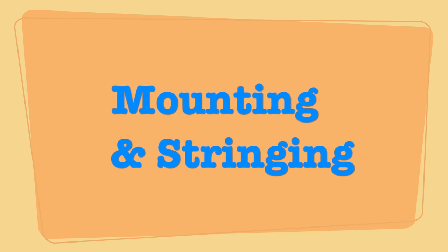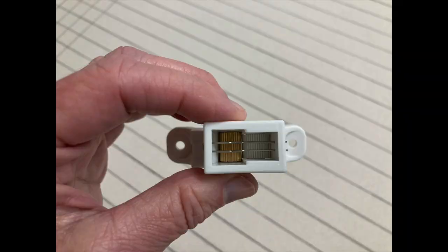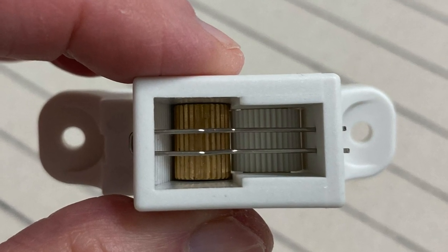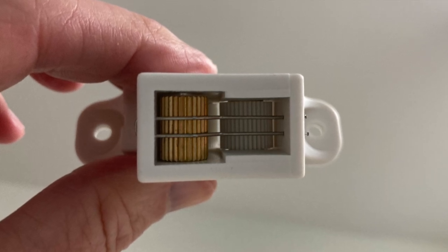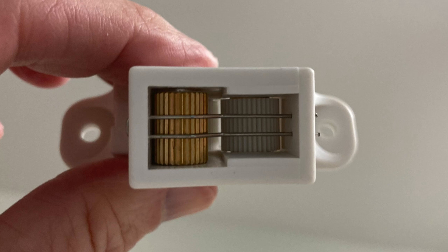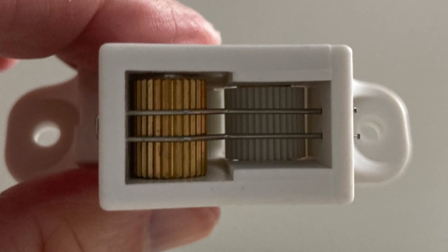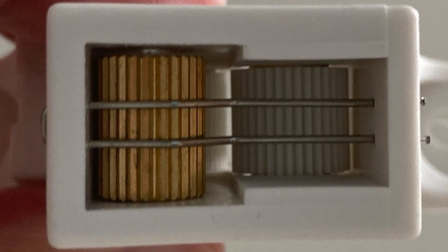Let's talk about mounting the tension lock and stringing it on your shade. Some people say to attach the cord lock first and then string it — I find that a much more difficult way to do it, and here's why. If you hold the cord lock upside down, gravity is going to make the two rollers roll up against each other and there's no gap to run your cord through. If you hold it above your head and give it a little shake, those rollers separate and give you a nice big gap to put your cord through. If your lock is already attached to your board, the board gets in the way of your hand getting in to feed it from the top. So I find it much easier to thread the tension lock completely and then attach it to the board.